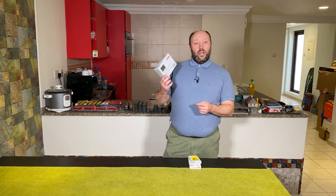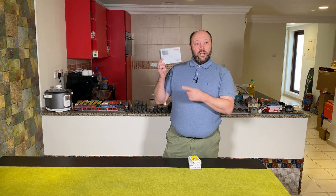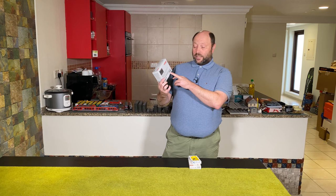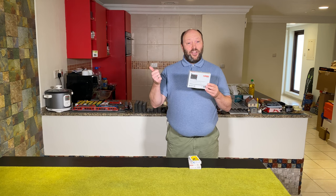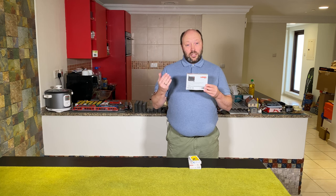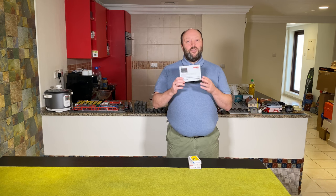The M84 comes in two editions. This one is the 60842, the black edition and the newest one. It also exists as the 60841, which is the white edition. The big difference is the black edition supports MFX, Märklin Motorola, and DCC, while the white edition does not support MFX — only Märklin Motorola and DCC. However, almost everything is the same for the two devices; you install them the same way.